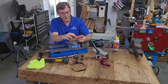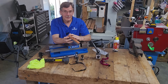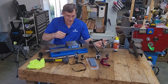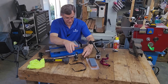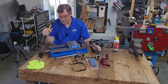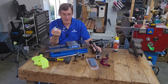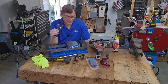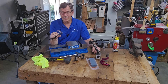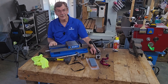I have a stone here — it's 320 grit on the finer side, which is the side I'm going to use. It's oil impregnated, but I'm still going to spray it because you can't overdose on lubricant when it comes to protecting your machinery. I have the T-nuts and the bolts for the vise, the wrench for the T-nuts, and a dead blow soft mallet that I'm going to use to tap the vise to get it trammed. Obviously, a rag — and don't forget about the safety glasses. It's always a good practice whenever you get around a milling machine or anything that cuts metal. You should be protecting your eyes.